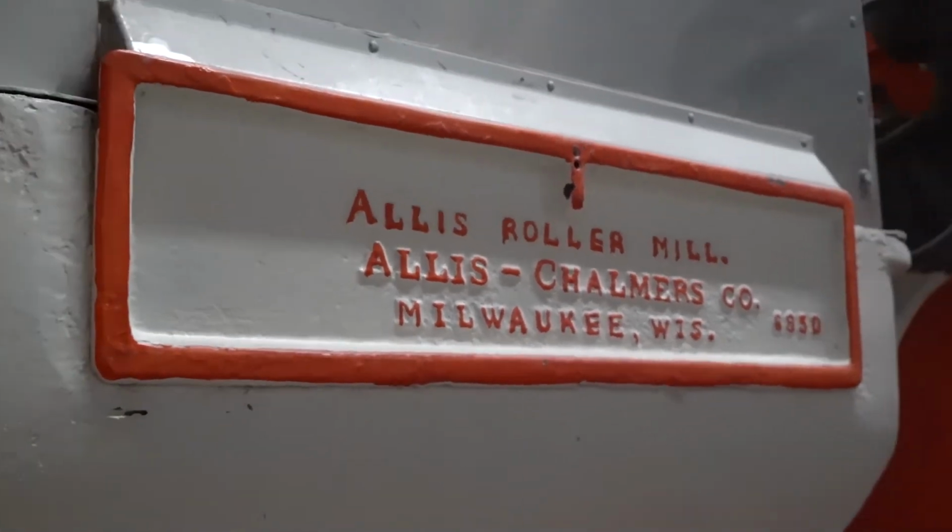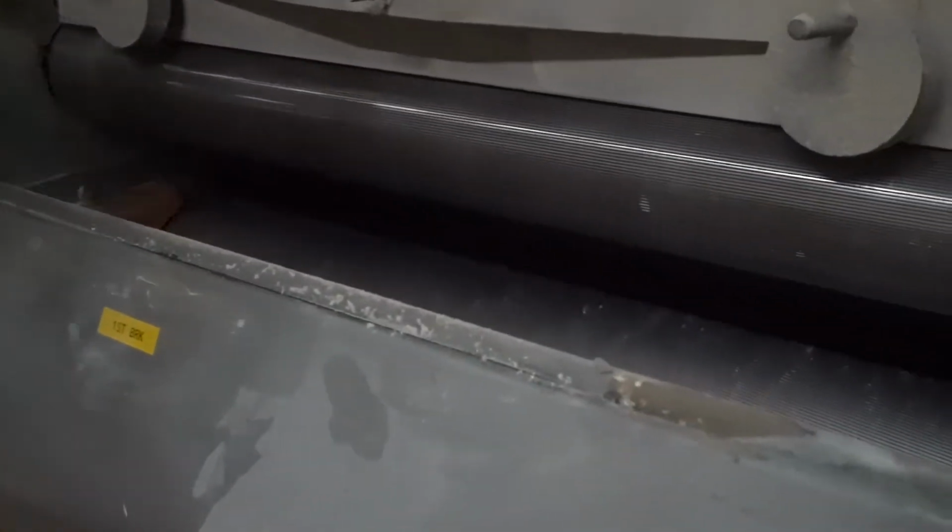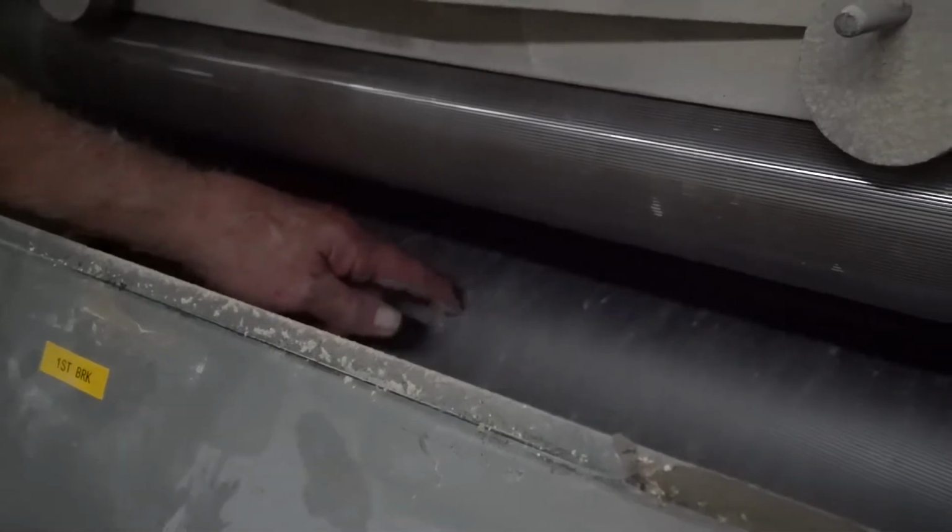So you have a roller mill. There's sets of rolls, and in the beginning they're corrugated, and it peels off the bran. Then it goes through a sifter, you can separate that, and the white flour is the starch inside the seed. And it's about the only way. It keeps circling through these different degrees of corrugation until it ends up smooth, and the bran flakes are just like bran, like the horses eat, and people like to eat.